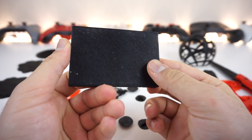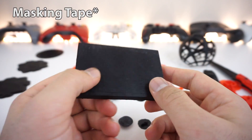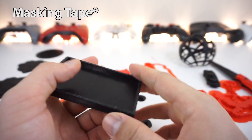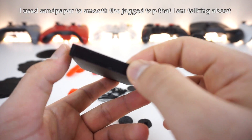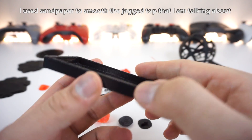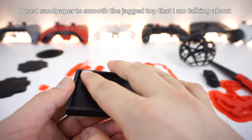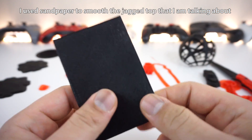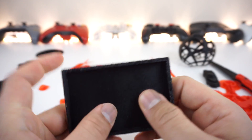The first thing I built was this tray — it's really nice. It was printed on scotch tape and came out fine underneath, but after I removed it the tape was mangled. I had to stop the build near the end because I forgot to put on the cooling nozzle, and towards the end it got really jagged and bumpy, causing weird noises. Make sure you plug in the cooler when you finish building the printer.